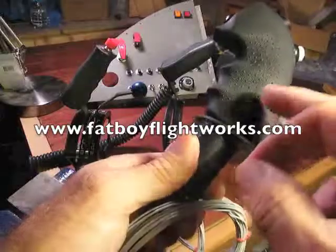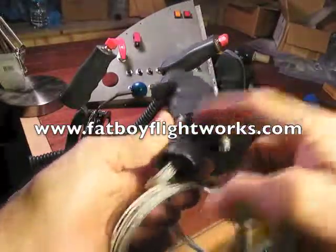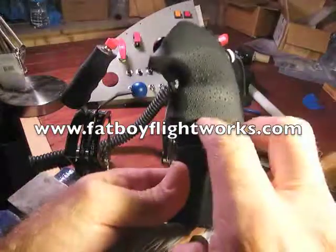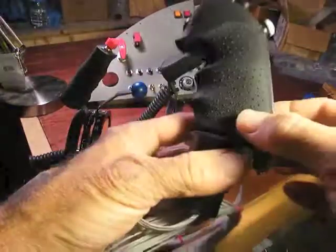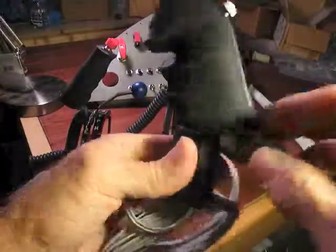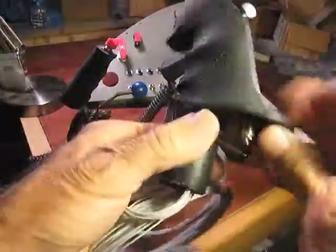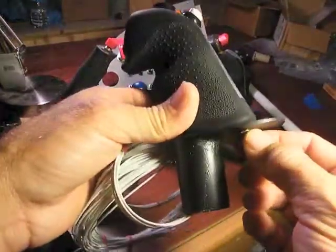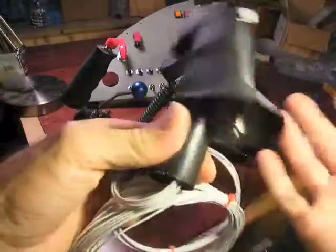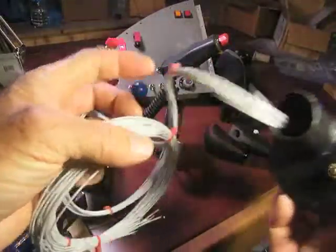A little bit of engineering here: the way this grip is mounted to the base, I've got two AN3 bolts that go through the bottom, up through a steel plate, and a flox bushing up inside of the grip. You can actually wrench down on the AN3 bolt straight up the middle and get it super, super firm for safety — it's not going anywhere. I've modified the bottom of this grip so there's no roll whatsoever; it sits flat on the base of this seven-ply fiberglass. For added overkill safety, I've got an aft AN3 bolt as well — two points of union, rock solid.